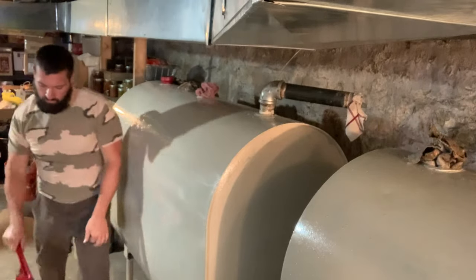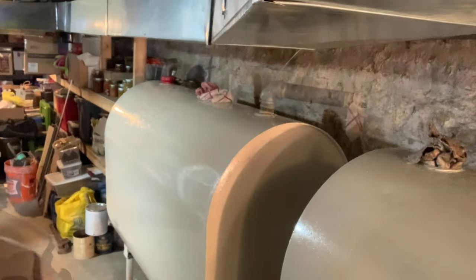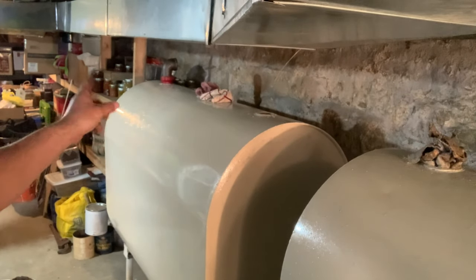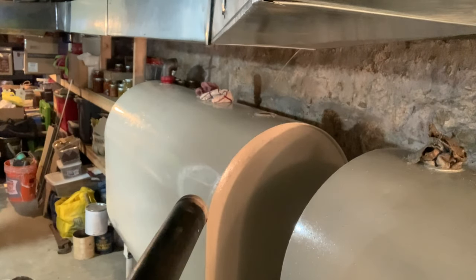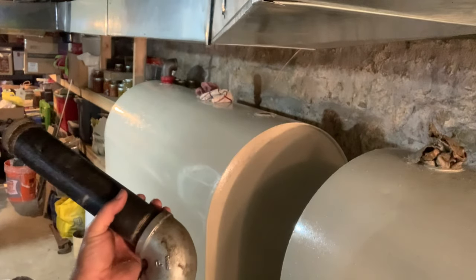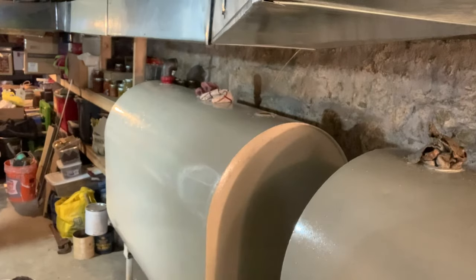Now that that's in, we can put our 90 over to continue plumbing in our vent. Now we have our street 90 attached to our whistle vent, and it's tight in our last bung. Now I only have a limited amount of time before our hardware store closes, so I'm going to skip over to the crossover and just make sure we have the right nipple for that.